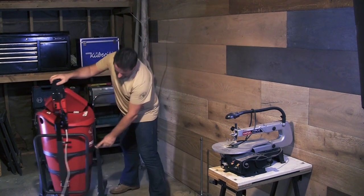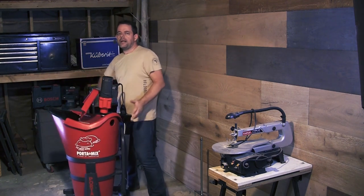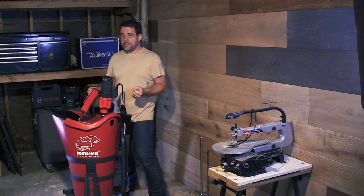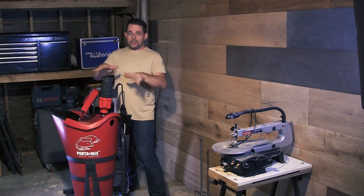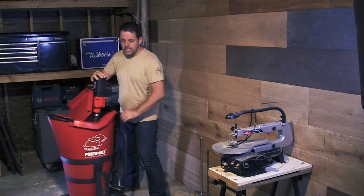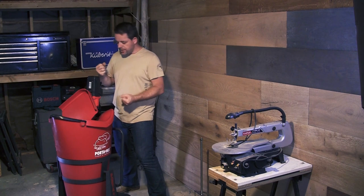You've got this release arm over here. So generally I'd say if you've got a full bucket and you're a little bit inexperienced, two people are required to actually tip this so you don't lose control of the actual tipping motion and you don't end up with all your screed in one little zone. But this can be managed by one person if you understand and you anticipate how it's going to move.